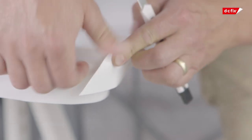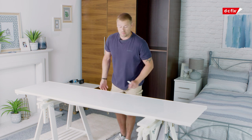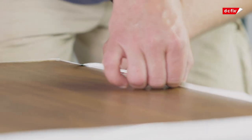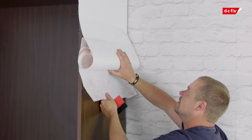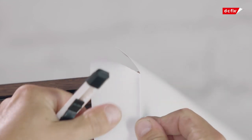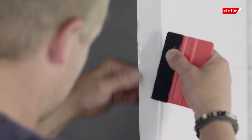Now that we've finished with our corners and our edges, we need to flip it and cut off our excess. Now it's time to show you the sides of the wardrobe. The process is exactly the same: measure, cut and apply. My advice would be to start from the top of the cupboard, get a good grip, and work your way down. Use your smoother to smooth out the bubbles as you go. The great thing about DC Fix is if you do make a mistake, you can pull it off and start again as many times as you like.